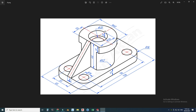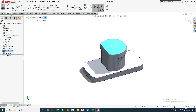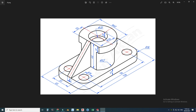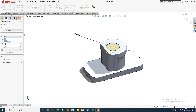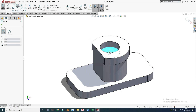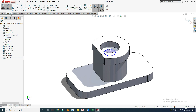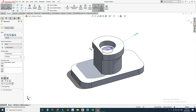We have a 30mm diameter, then 10mm deep, and then a 20mm through-all cutout. This can be made using a counterbore, but I will create it using simple sketches. Select this surface, select Sketch, and draw one circle with a diameter of 30 units. This circle is cut through 10 millimeters, so go to Features > Extruded Cut with a 10mm cut downward. Now draw another concentric sketch with a diameter of 20 millimeters, and this extrusion is Through All.